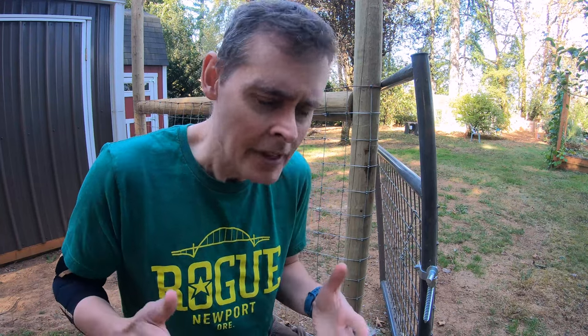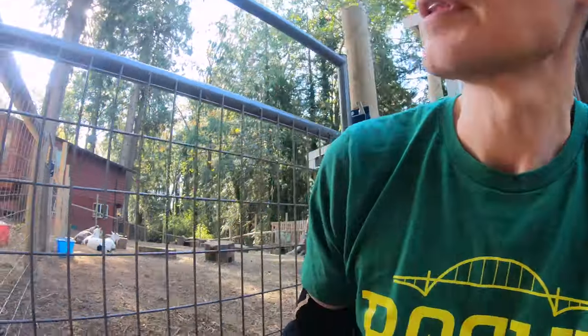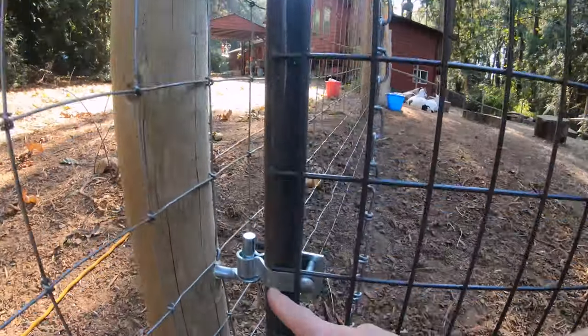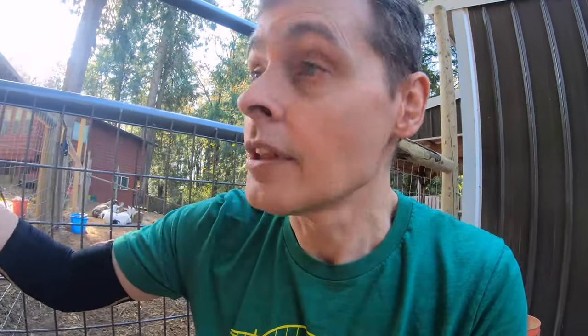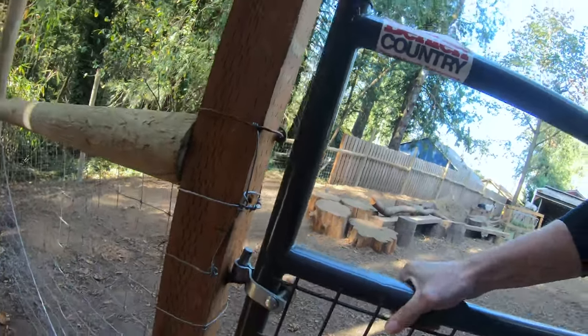Full disclosure, I have been hanging my other gates wrong. These guys look like they just screw into the post and the gate just sits right down on both of them. But instead of doing it that way, the top pin should be angled downward, locking that gate firmly into place. We have never had a problem with animals lifting a gate off of these pins — maybe it's because our gates are small. But when they're closed, there's just no way this gate is coming off those pins.